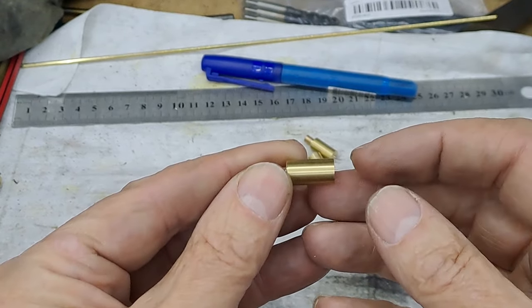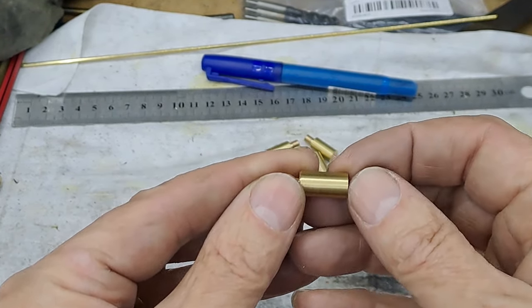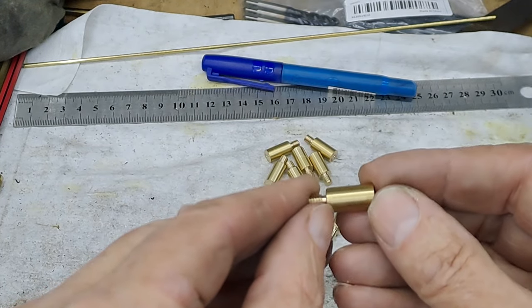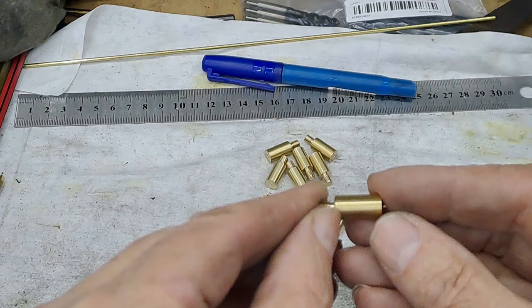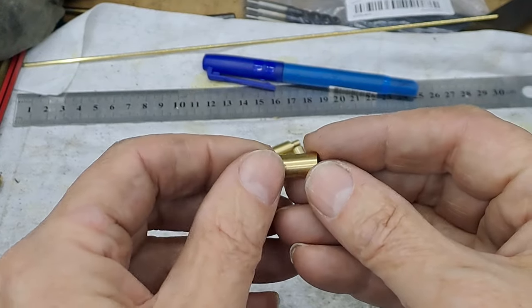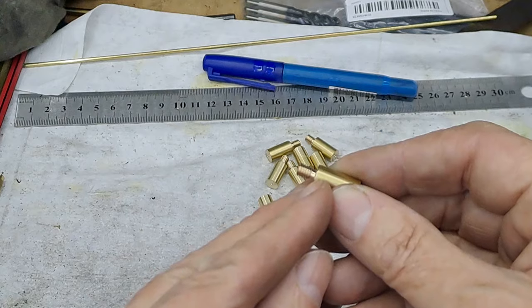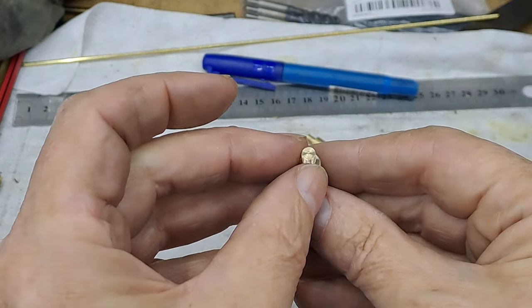We're going to center drill. We're going to go in with a 5.2 millimeter drill, so tapping M6. Go down to 14 mil, so the very tip of the drill is going to just fall short of the very bottom. And then that last little bit, from a millimeter at the bottom all the way through, is going to be 3/32.